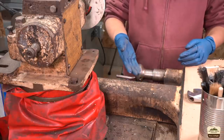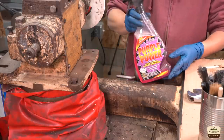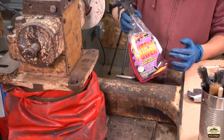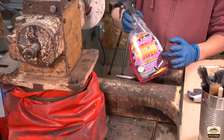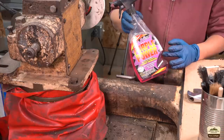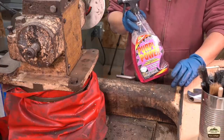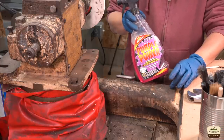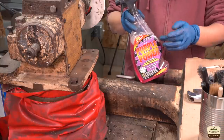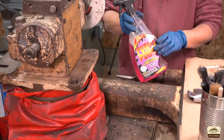When I'm cleaning a machine I use a number of different cleaning agents. Windex, sometimes purple power. Keep in mind it works great if you use full strength, however it will react on your painted surface — it'll make the paint soft and even soften the body filler underneath it. So bare steel works great. If you're going to use it on a painted surface you do want to dilute it.